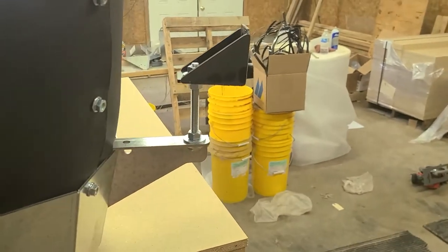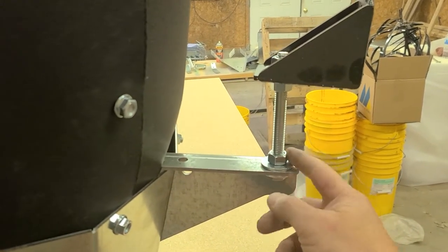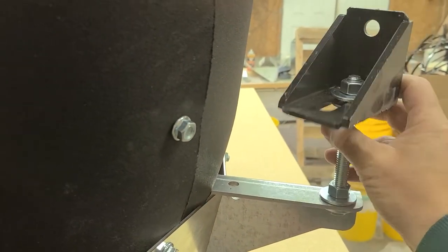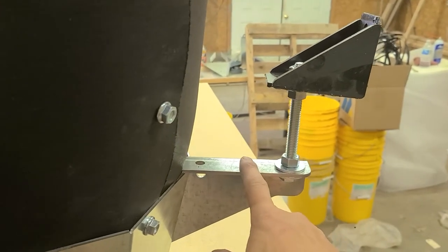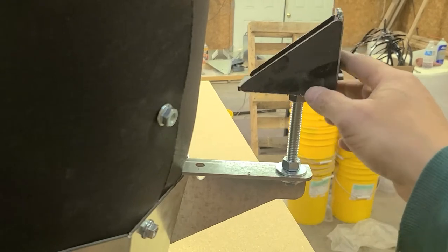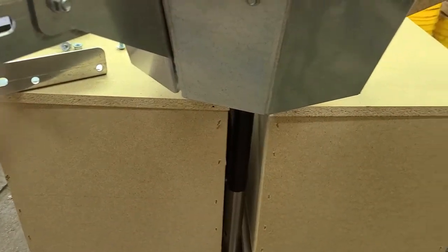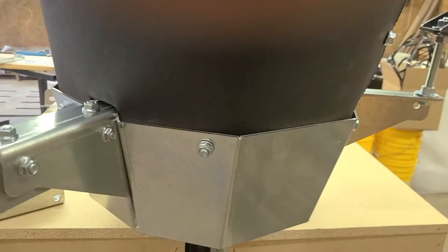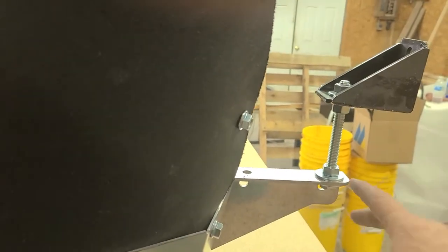As far as the hanger brackets that mount the spreader to the bin, use the five-inch long all-thread half-inch bolt. Put a jam nut down all the way. Use a washer on both sides of the hanger bracket — the hanger bracket is adjustable here. For the bends with the smaller opening, the bolt goes directly on the mounting hanger bracket. You just adjust the nuts to allow for your shaft to be perfectly straight. I always use a little magnetic level on the shaft when leveling the spreader — sometimes I have to use my phone to take a picture of the level to read it, but that works pretty good. You do want that shaft straight when you are installing it.